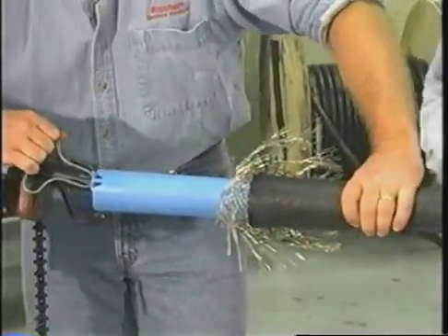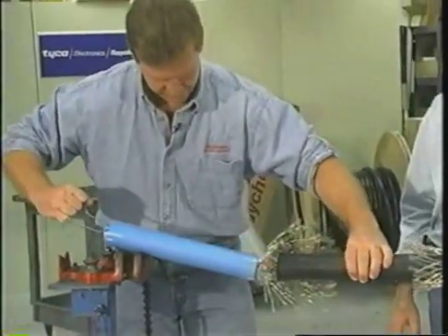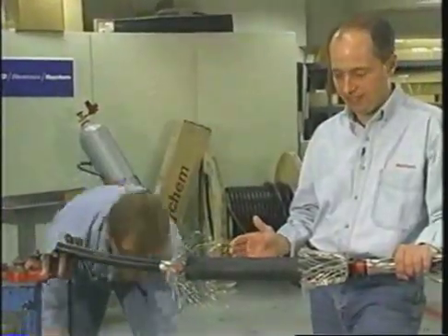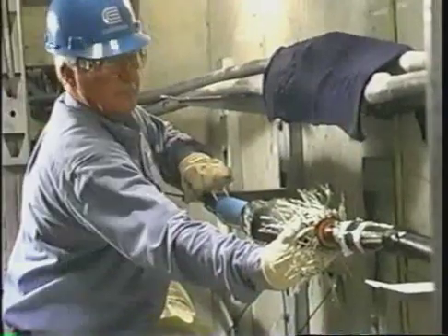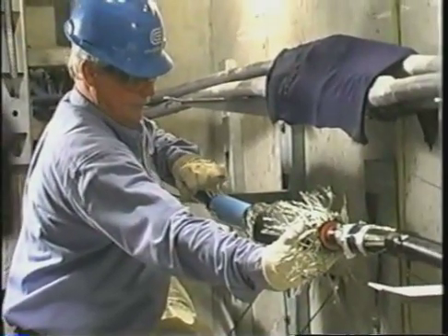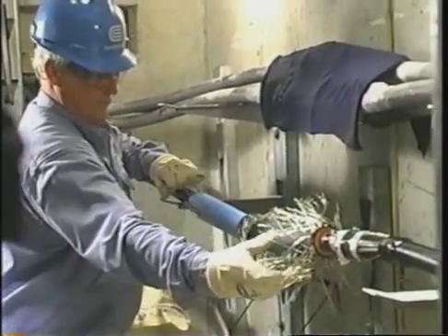Go ahead and finish installing it — you're looking pretty good down at this end. The joint is now shrinking onto the cable. So you're not using any of those rip cords which can snap off and break — no rip cords. And you can move it around a little bit while you're installing it; it's not like when you get started it's stuck.